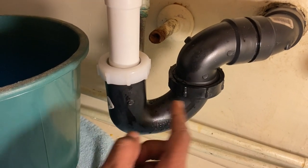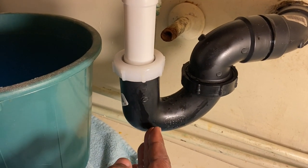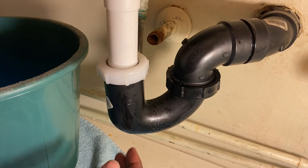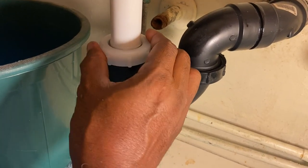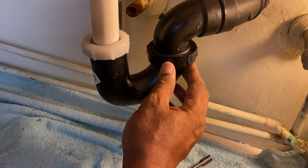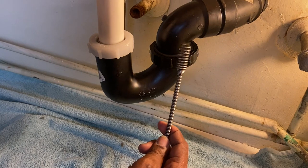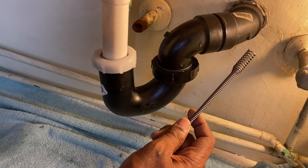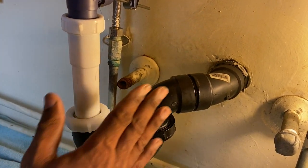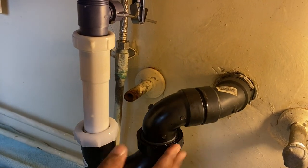This is the p-trap. When the cable is coming down, it hits this curve and it's hard to get around — it stops. What's usually done is the p-trap is removed and then the auger is fished by hand up into the drain pipes. You can remove the p-trap by unscrewing these fittings and taking it off while the auger's inside, or remove the p-trap completely — make sure you have a pail to catch the water — and start your auger from that point into the drain. When putting the pipes back together, don't be too rough with them. They're plastic, and if you're too aggressive you can crack them or break the seal somewhere in the pipes.